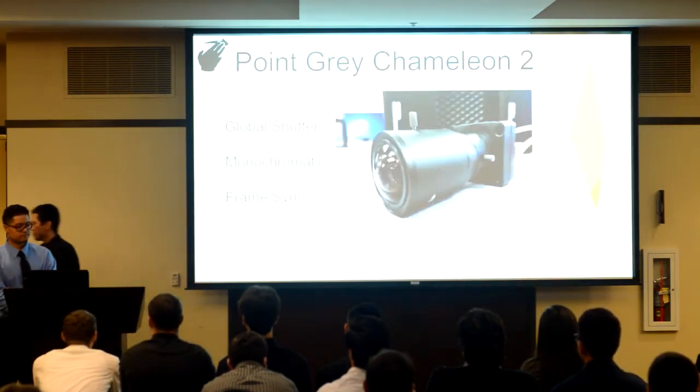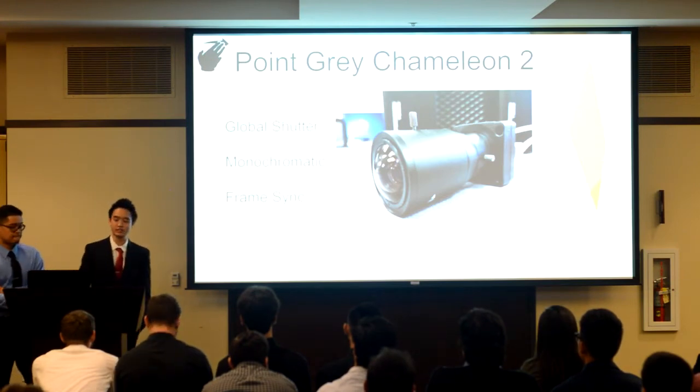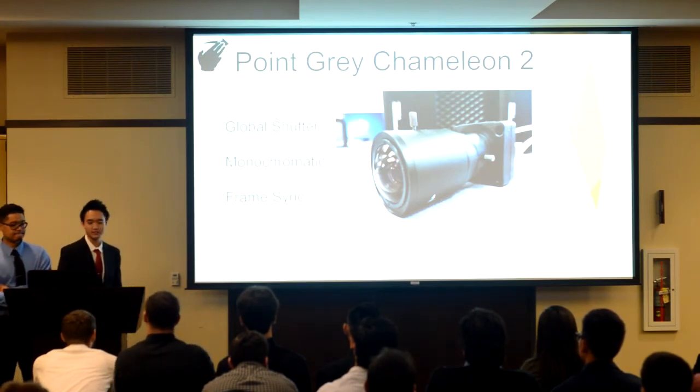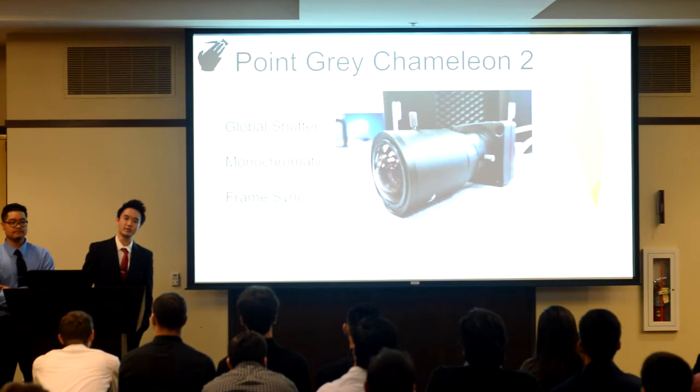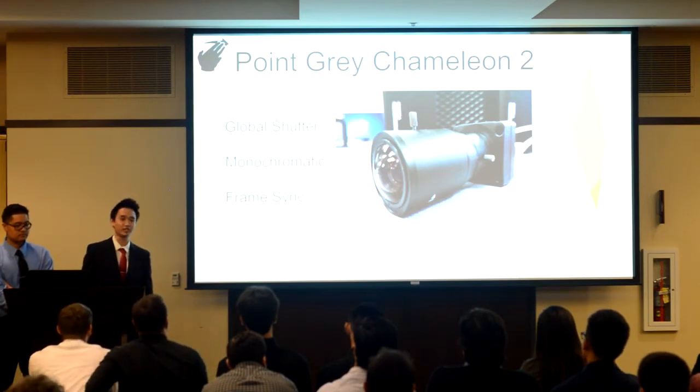Thank you, SWAT. To elaborate a little bit more on what Emil said about our hardware background subtraction, I want to explain a few key concepts about our system. Our system is using a Point Grey Chameleon 2 camera. It's global shutter, it's monochromatic, and has a frame sync signal. A frame sync signal is a signal that the camera will output signifying that it's capturing a brand new frame.